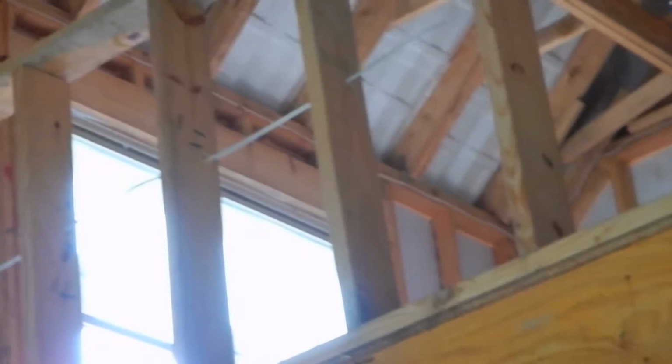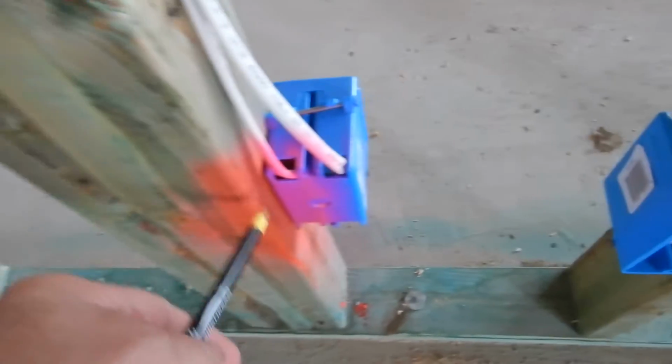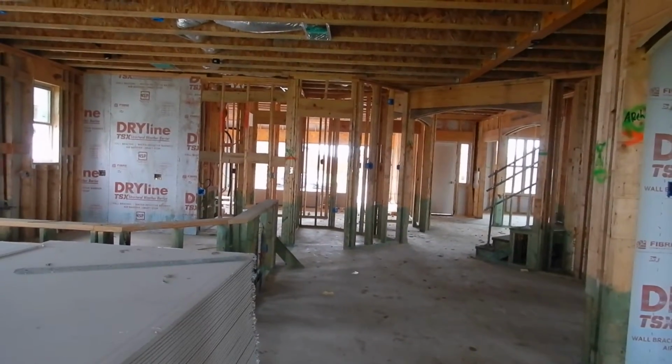So, moving on along, we're back into the living room. I did some backing up and I showed you that siding. Okay, soffit baffles are there. I had some other issues from the attic, if you remember. In here, most of these are okay, but sometimes the backs of these are less than 1.5 inches, so we really should have a nailing plate right there. This is again the south. All right, so this would be the west wall in the living room.